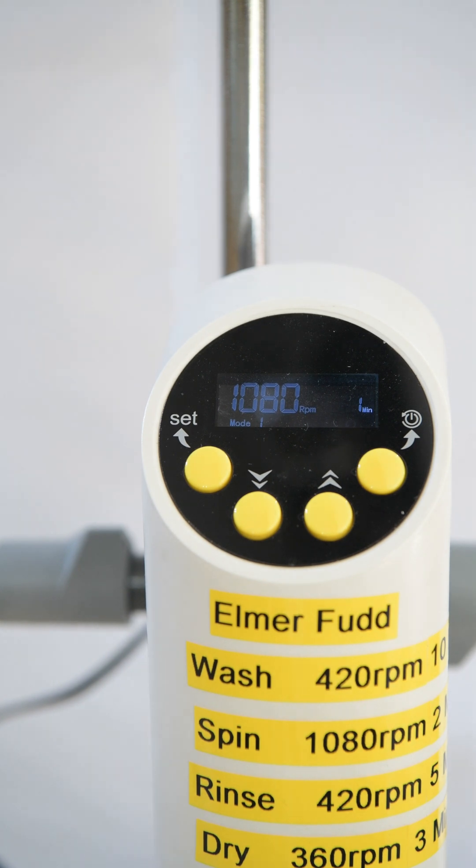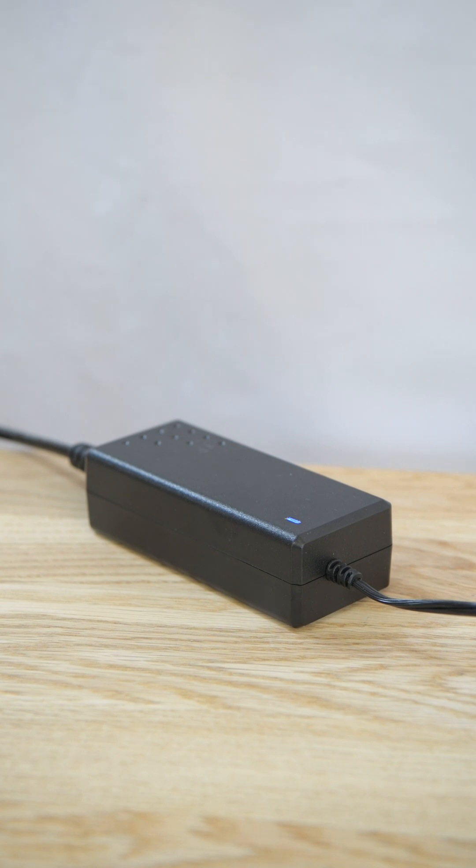This is an AC to DC converter. It takes an input from 120 volts to 240 volts and converts it to 24 volts direct current. It's rated at 8 amps and puts it out through a 2.5mm barrel jack, centre positive. The motor in this thing is a brushless DC motor. If you change the pin polarities around — from centre positive to centre negative — then the rotor spins in the opposite direction. So it would be possible fairly straightforwardly with some control electronics to convert this into a reversing motor, which would be quite good.